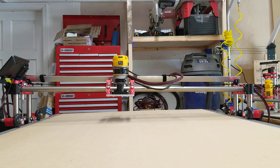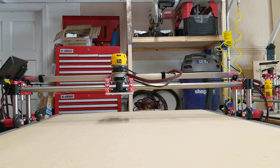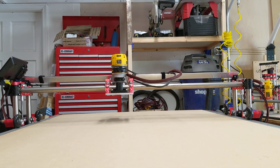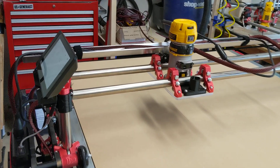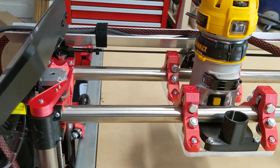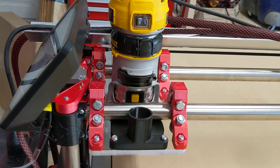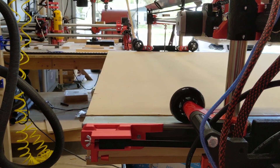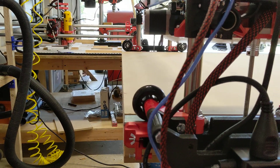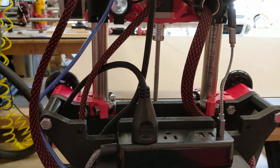Left side is up. Right side continues up. Left side is up until it's nice and level. Then it will home the X-axis, which is the short one over here — you can see its limit switch is right there. I've purposefully placed the Y-axis out of square a little bit too, so the far side will reach its limit switch before the near side does. And that's it — she's squared up and leveled.